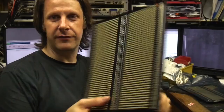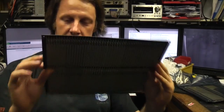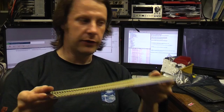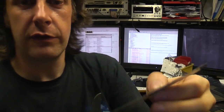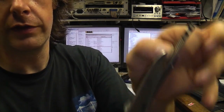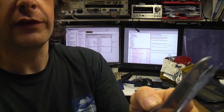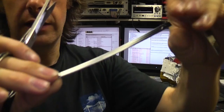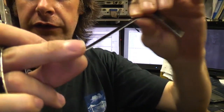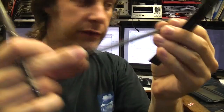I've got about seven of these boards to do — a total of nearly 700 PCBs. So I started thinking about how I was going to do it. Because this is on 0.8mm board, you can actually cut through it with scissors, and the scoring line does guide the scissors. The problem with that is you tend to end up with a slightly curly board, which you can straighten out but it's not ideal — it's a bit of a pain.